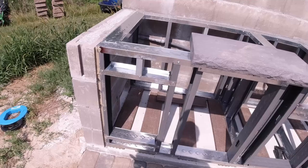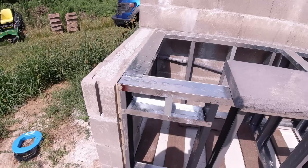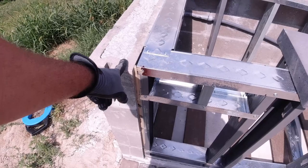You can also see where the metal framing came up against the blocks. There are some gaps — either I cut it short or it's out of alignment. I went through and filled all the gaps with liquid nails to fill the gap and give another bond point between the wall and those blocks.